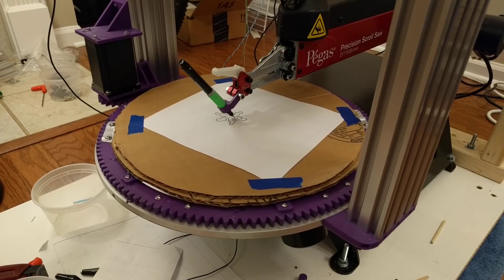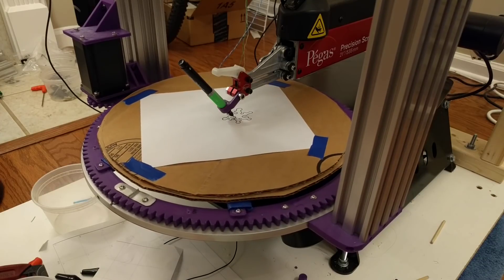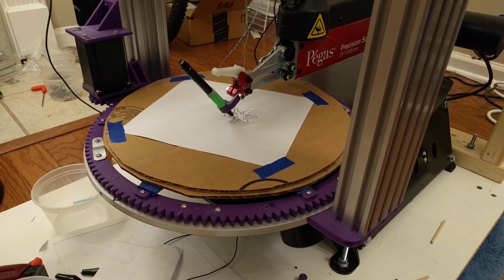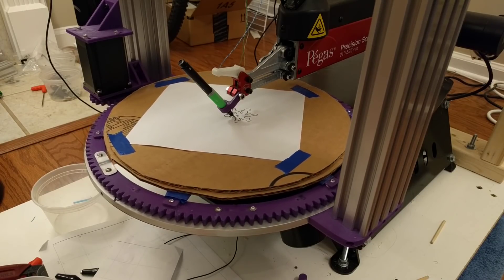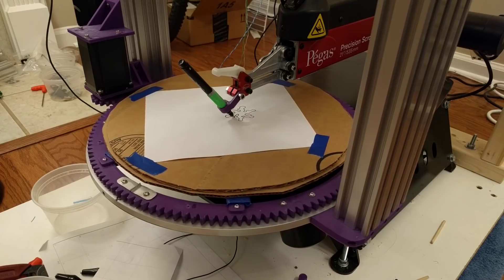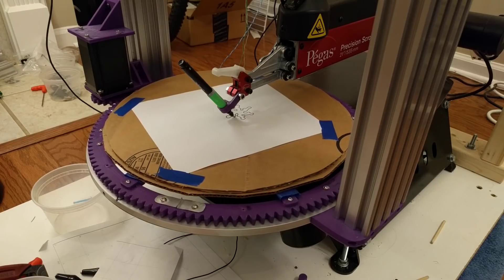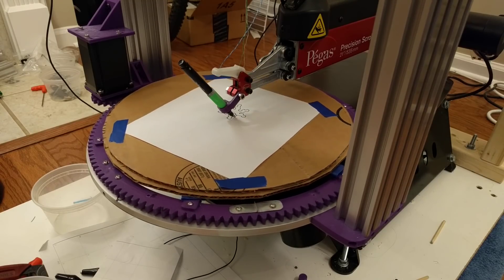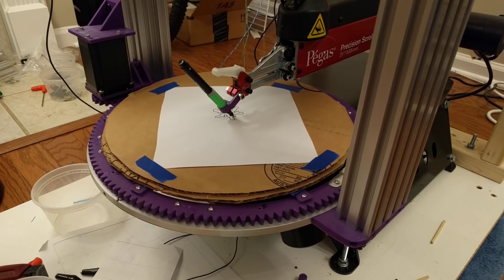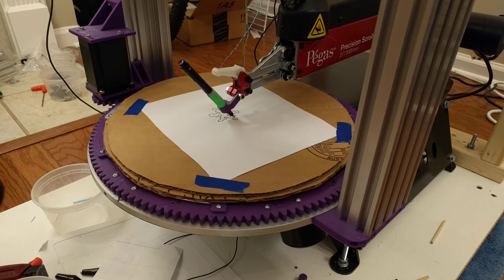This was originally designed to cut jigsaw puzzles. The way that works is that the workpiece starts with a very small starter hole in the dead center. After homing the machine, we insert the workpiece and thread the saw blade through that center point. Then, cutting one piece at a time, we cut the piece and remove it from the wood entirely. This gives us a free space so we can move anywhere in that free space to start the next piece.